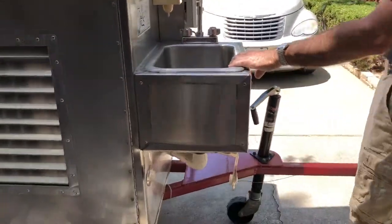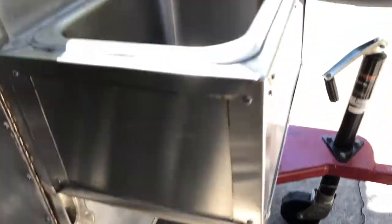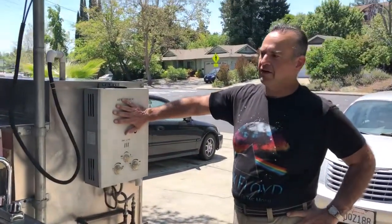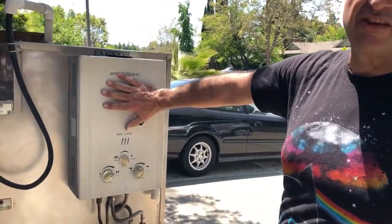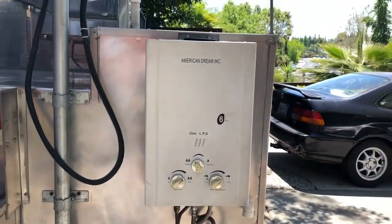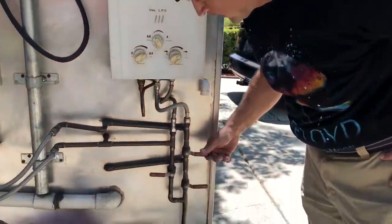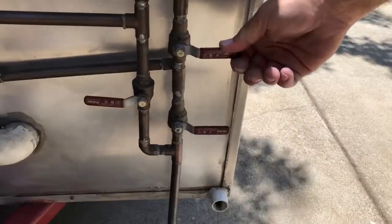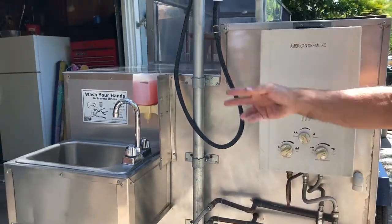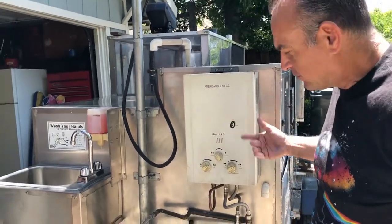We've got the required hand washing sink, required soap dispenser, and the water heater. This is on-demand water, so once the water system is pressurized — which takes just a second or two — all the water runs through here and gets hot within seconds. I've built in a feature where this lever allows me to recycle water from the fresh water through the pump back into the fresh water container as the water gets warm, so you're not wasting water waiting for the heater to get hot.